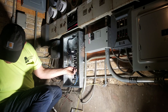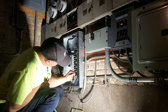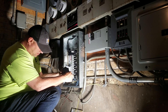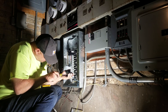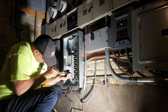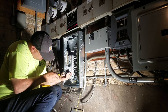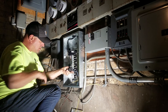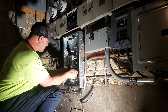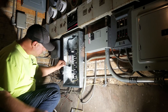Gauge them correctly. This old wire — I don't know if I strip it. It's probably 14... no, it's 12. So number 12 is gonna be a 20. What I do is I bend my wire to where I know it's gotta be stripped back, and then put it on like this — out of the panel. I know this is off by the way. Turn it off first. Then I just put it in where it's supposed to go, and you're not fighting with it. Argument could be made the other way — it's just a preference.